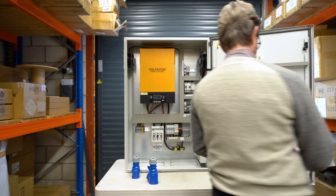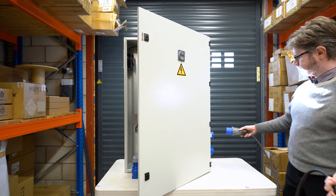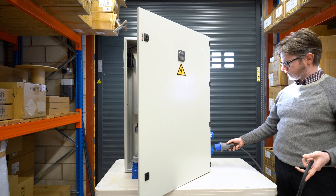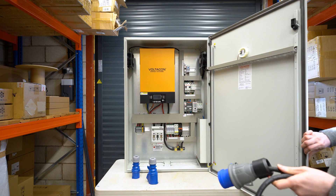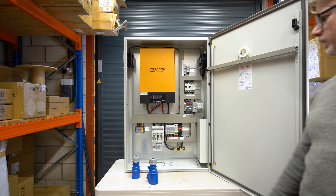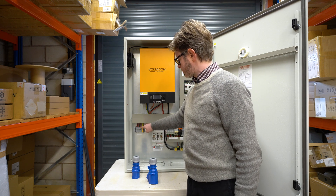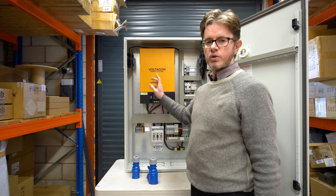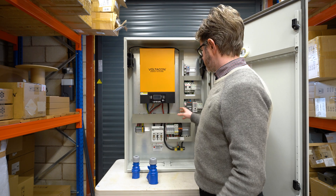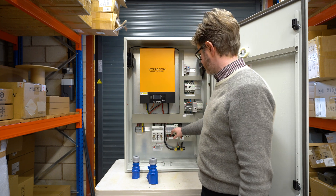you plug this straight to the back — that's the AC output and the AC input, so there is nothing else you have to do except the mains cables. On this side we have the power coming from the solar panels; we have two strings connected in parallel. Bear in mind there is only one MPPT charger, and to increase capacity and give more flexibility to customers, we added two parallel strings.